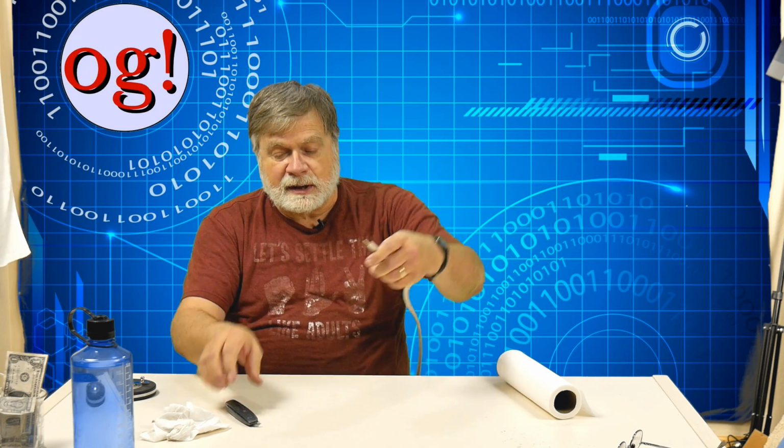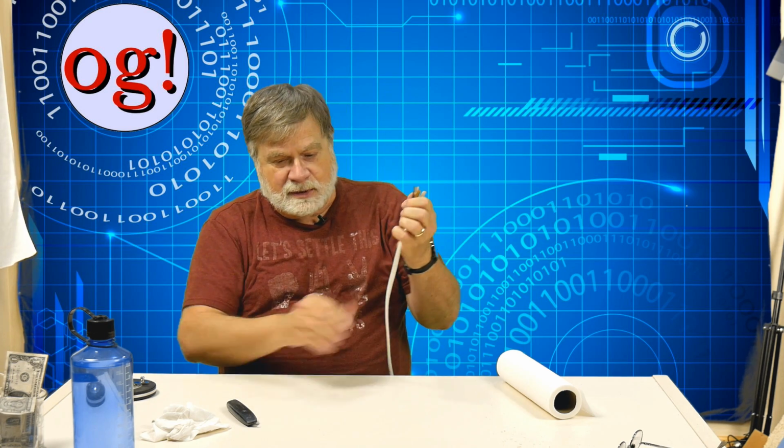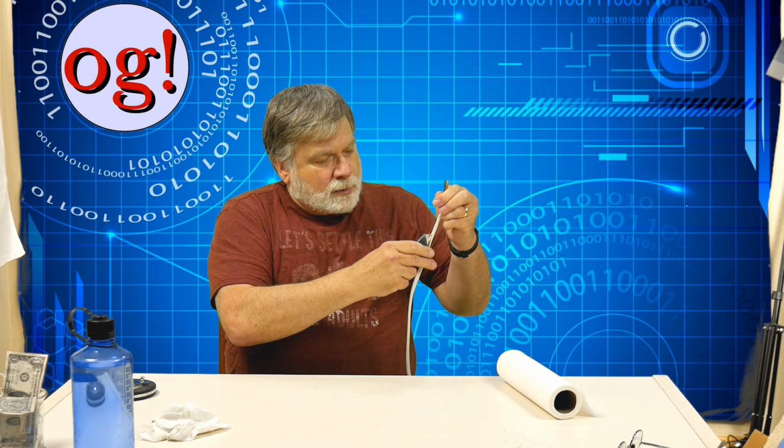Now the question is, how do you get the wire out of the Romex? This is an interesting little knife. This knife right here is designed specifically for splitting Romex. If you cut Romex before you use it in a house, you have to get at the wires that are inside. So this little tool is a hook, and it goes in there and it just splits the wire. So now let's see, we only have 20 feet to go. But what you'll find is sometimes this hook will get snagged on what's inside.